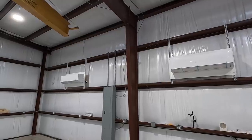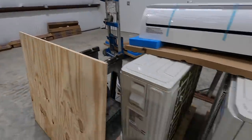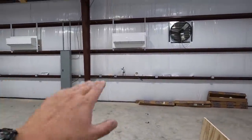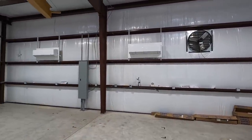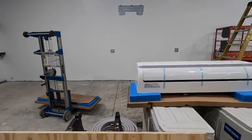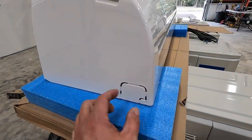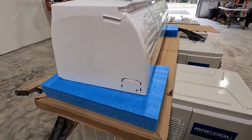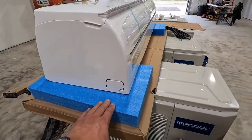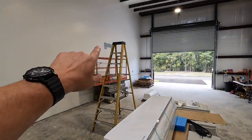Now we've got two of our air handlers successfully hung on the brackets. Next step for those is to go ahead and get two of our condenser units moved to the back side. I'm going to start getting these guys set in place since I didn't want to set them until we had the placement of our lines coming down. Our lines are going to be coming through this little cutout here. Our line guard will be mounted on the wall in line parallel to this hole, and then we'll have a second line guard mounted directly below that going underneath the unit and hooking into that air handler on the other side.